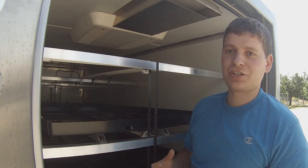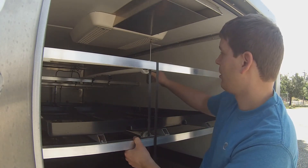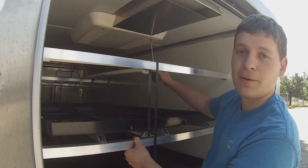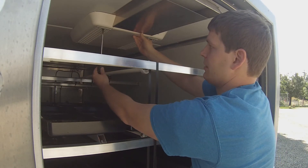What I want to show you real quick is how to check the filters and change them if need be. The filters for the air conditioner are located under this plastic cover on the ceiling of the machine, and there are two black thumb screws up on the top. Just give that a quarter turn, and give this one a quarter turn here as well.